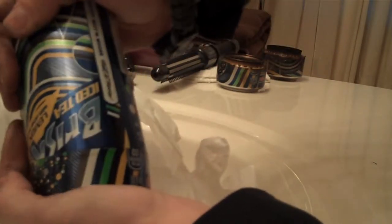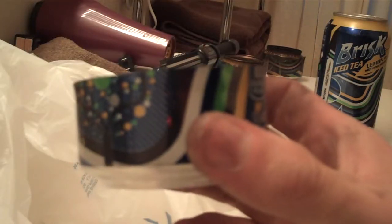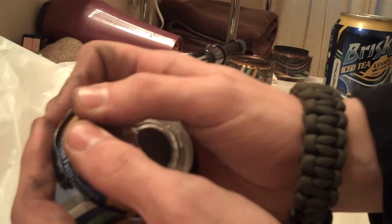This might take a few minutes, but if you push hard you'll actually see it start to bend and flare out. Make sure your edges are clean so you don't rip the metal. You can see it flares out a little bit — this may or may not be enough, but we'll try it. Stick the inner piece in and press — it flared out enough so it actually slides neatly in. Before pushing it all the way down, make sure this piece is a little bit smaller so it pinches down on the inner piece.